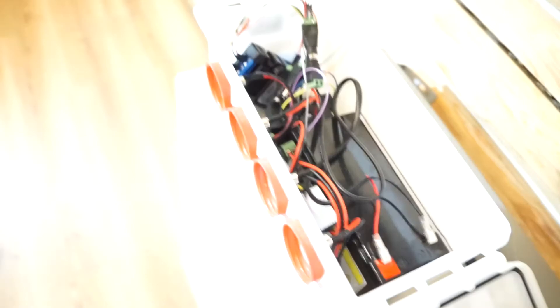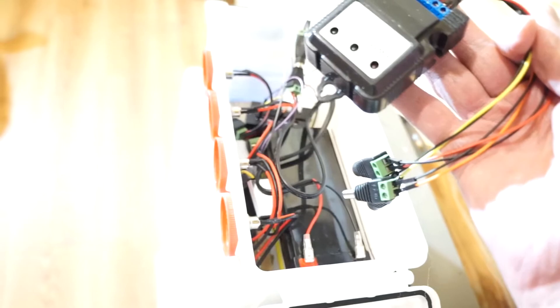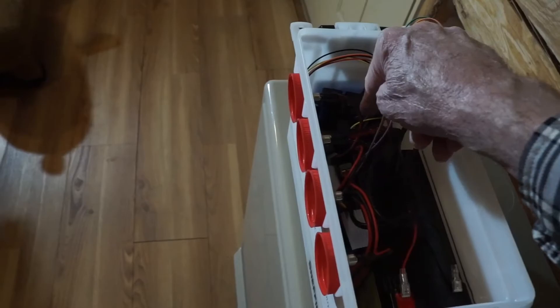The reason it's set up this way is so I can take the battery and hook it directly to the DC bus, then connect to either the 9-volt or 6-volt converter, or neither if I'm using 12 volts. The solar charge controller draws about 13 milliamps when there's no power from the panel, so during winter I'll hook the battery and solar panel directly to the bus.